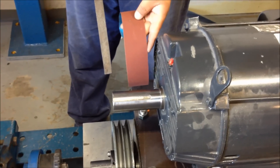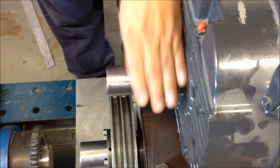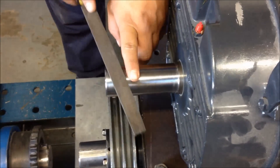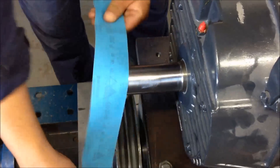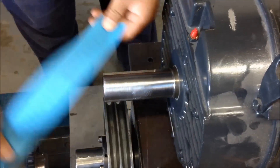The FSC belt pulley comes with a precision bore shaft. It is very important that the motor and shaft be in good condition. Use a fine file to remove any scratches or dings in the shaft surface. Use an emery cloth or fine sandpaper to remove any rust, paint, or debris from the shaft surface, and then wipe it clean.